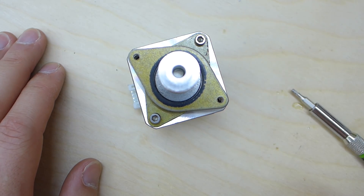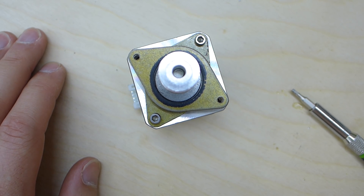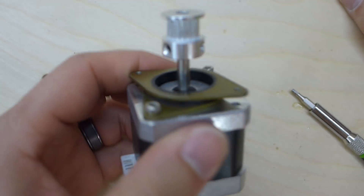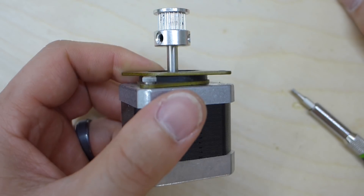Normally you don't need these on the Z axis or the extruder. These only make sense on your X and Y because that is what's moving most frequently and the fastest. Your Z speed is going to be much lower than your X or Y, so that's why these are so useful on your X and Y steppers.